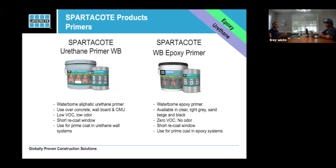Want to go? Oh, yeah, sure. Urethane primer is a water-based primer, low VOC, low odor. This is really used as a primer for our wall systems. We have a urethane wall system, and that's specifically what it's for. You go over concrete, wallboard, or CMU. And then our water-based primer is how we used to really build our metallic systems. It's a primer that you can make the floor black for your metallic system and be able to get on it fairly quick. Zero VOC, there's no odor, and like I said, it's got a short recoat window.